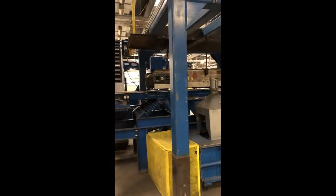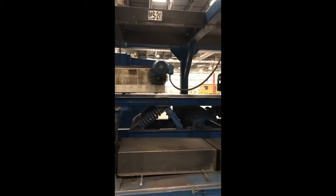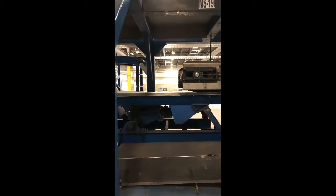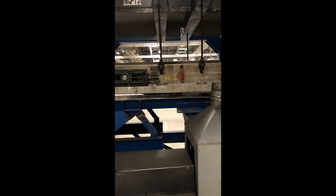Once the fines are removed, it continues down the shaker conveyor with 1 overbelt magnetic separator that picks the material up and drops it. The non-mags come down onto this conveyor. Then the magnetics that remained up there hit another magnetic overbelt conveyor. The non-mags drop down below, and the mags continue on and hit a 3rd variable magnet.